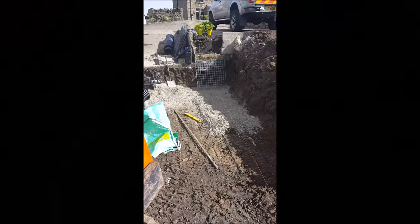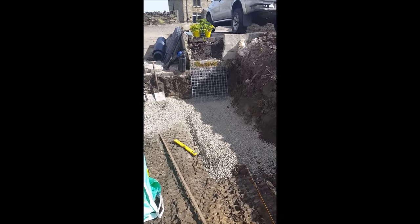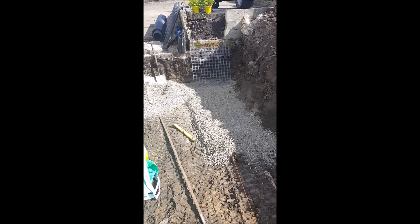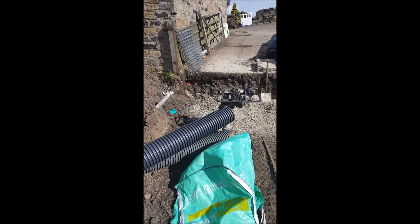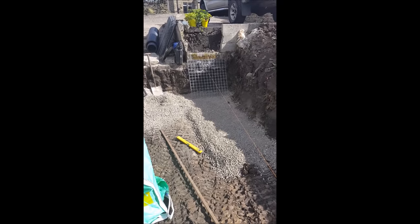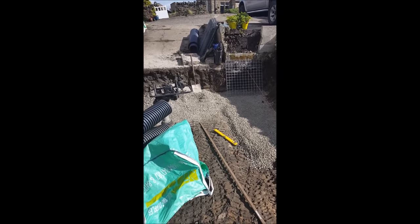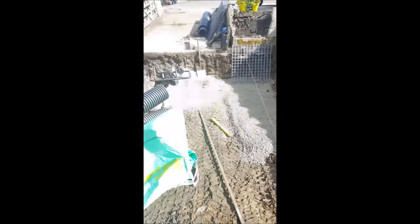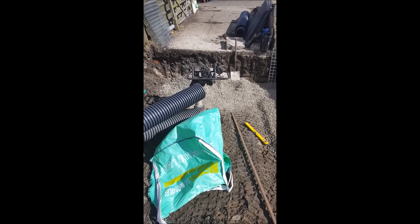It's Tuesday morning now — we got to site about an hour ago. I've just dropped a load of limestone crush to add to the base of the baskets and just started leveling that pad there. Going to do about three meters that way to start with, and three meters the other way. Just got to take that post out quickly, then start putting the baskets together. Not going to go any further today — I want to get these two-meter baskets up first, get them nicely and solidly fixed, then start moving stone into the middle where the dumpy bag is and work my way around from there.